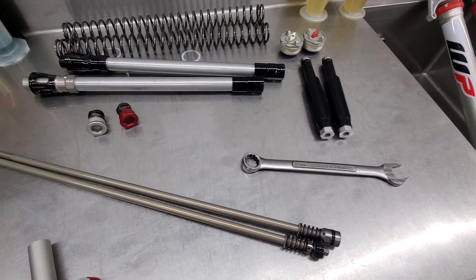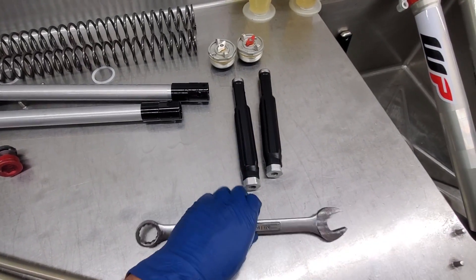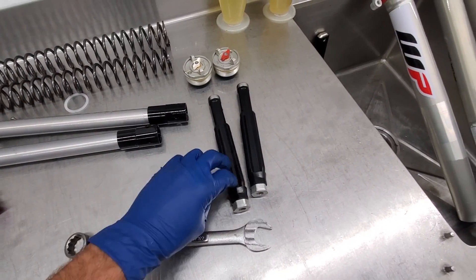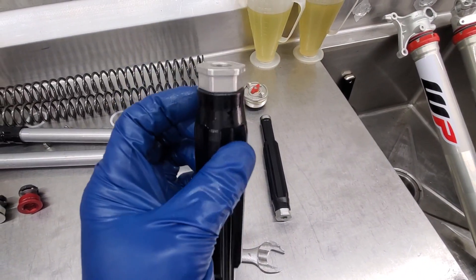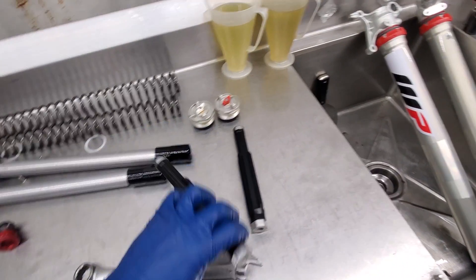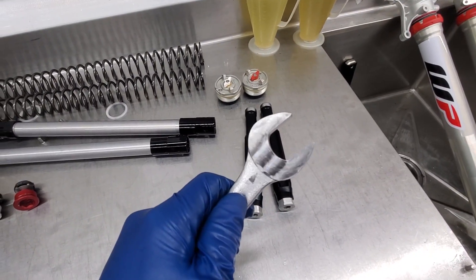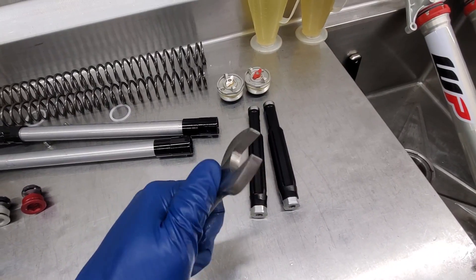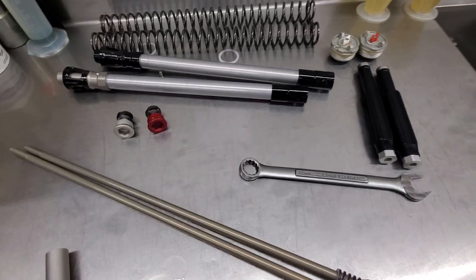The couple of tasteful changes we can see right off the bat are the spring guide — it's really nice. They made a 22mm machined ledge on there, so you can put your wrench in there and not have it slip off, just like the old ones did. For you guys at home working on your own stuff, if you don't have access to a mill, that's good — use a grinder on that to get it thin enough to slip in there, and please don't use pliers on that stuff.